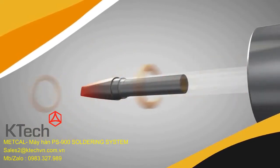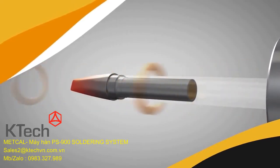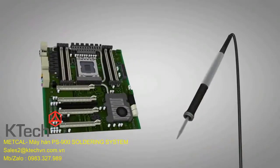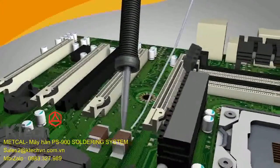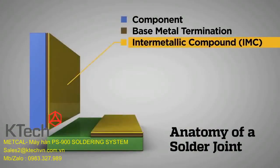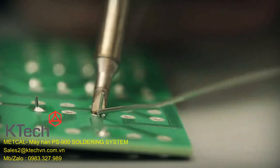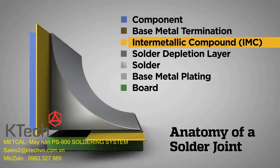As the tip temperature is constant and heat is not stored in the tip like a conventional soldering iron, the SmartHeat system applies direct power to the joint. Soldering results in the creation of an alloy between the solder and the metal surface that does not melt — the IMC forms due to a chemical reaction between the solder and the surface metal. Although usually disadvantageous due to the intermetallic phases being typically brittle and prone to crack growth, small amounts of IMC formation indicate that the soldering process has formed a good solder joint.